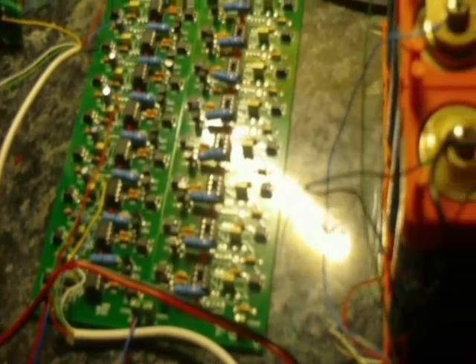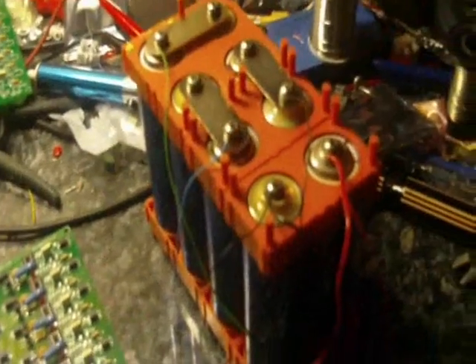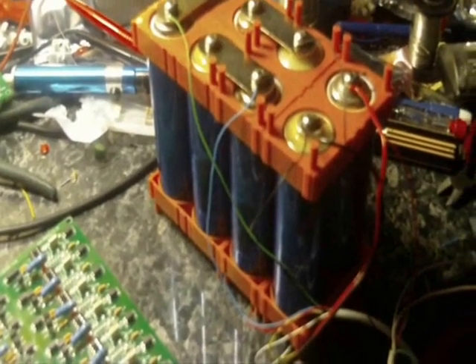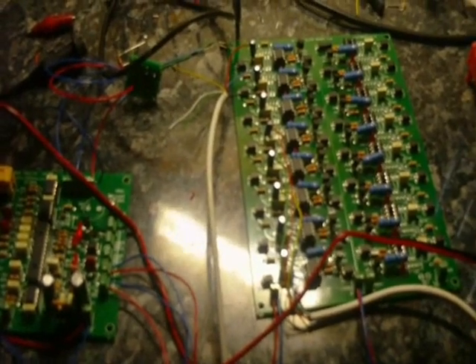This is the first test to see how the shunting function is going to work. These cells are quite poor quality — they are 8 amp-hour 38120 cells supplied by a company called eCity Power in China. It will be quite interesting to see how the system copes with this. I'm going to have to do some extensive testing before I put it in the car.